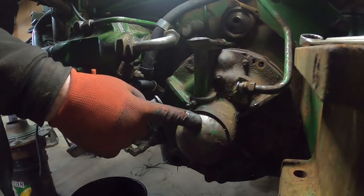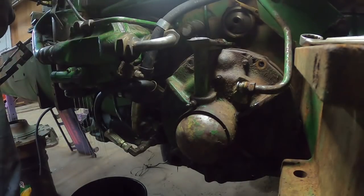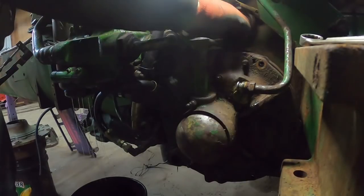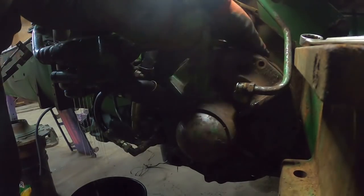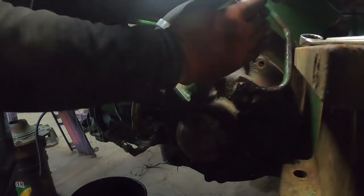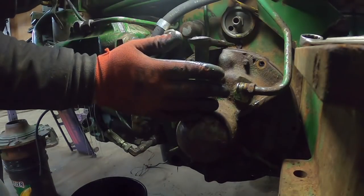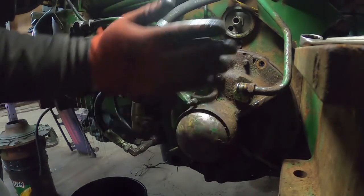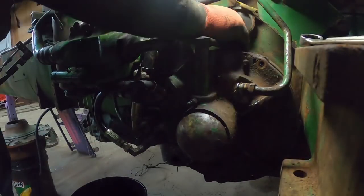I was going to adjust the parking brake in farther to get it to push the rest of the way off. As you saw, I re-engaged the link to the parking brake and then just moved the lever. It pushes the piston in to engage the brake for parking since the bolts are out, and pushed the cover out because that was the path of least resistance.